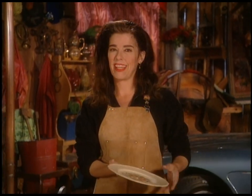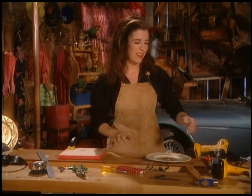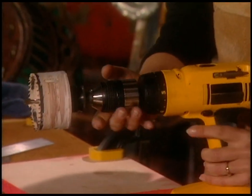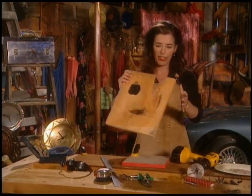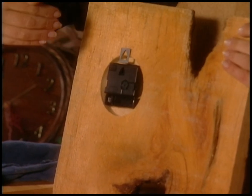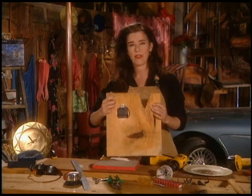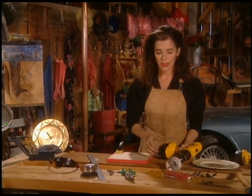The drilling technique on a piece of wood is just a little bit different. For one thing, you need a slightly larger drill bit — a four-inch hole saw. It looks kind of evil, but it gives you a nice hole. When you hang a wooden clock, because it's already fairly thick, you need to cut in so you can put the pack of clockworks on the back and sink it a little bit. That's why you need the hole saw.